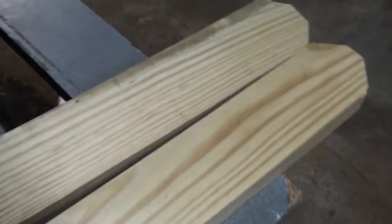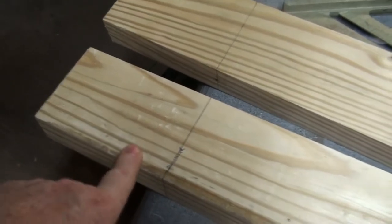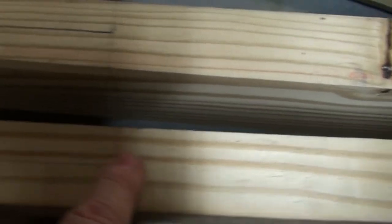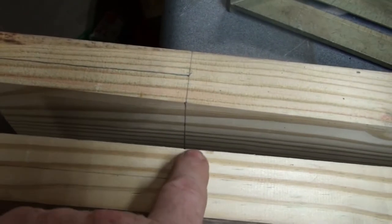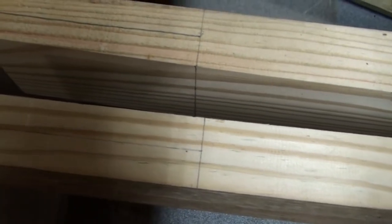I got my chamfer top — they're not perfect but I wasn't trying to be. I have five-inch baseboard at the floor, so I'm going to have to notch this out for the baseboard because I want it to go all the way to the floor. I'm going to do this cut using my crosscut sled and finish up the long cut on my bandsaw.